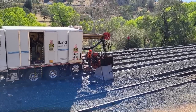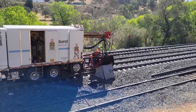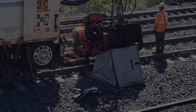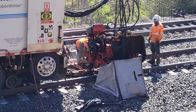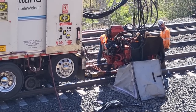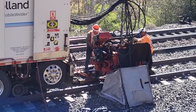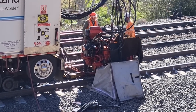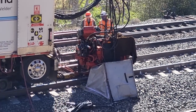It takes a long time to set up a thermite — you have to heat the rail, preheat it, you have to do a lot of stuff with the thermite type. So this is definitely time-saving and labor-saving. Now they will grind everything flush, and that's another thing with the thermite type — it leaves a pretty big mess around the outside. Back in the old days they used a handle chisel and a sledgehammer to knock all that stuff off, then a hydraulic press to knock off the leftovers, and then they have to grind it. This doesn't leave that kind of a mess, so as soon as they're done, they can just grind everything flush, make it look pretty, and move on to the next weld.